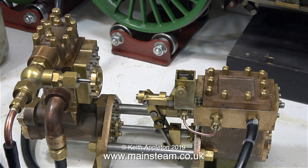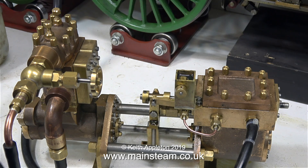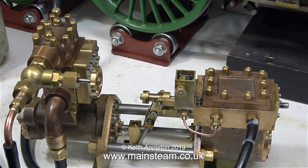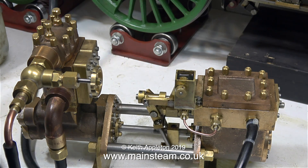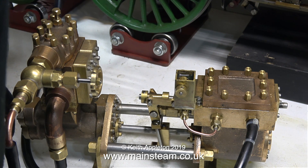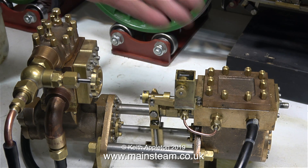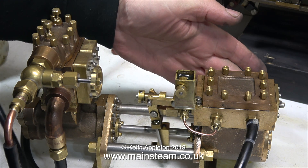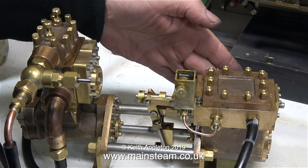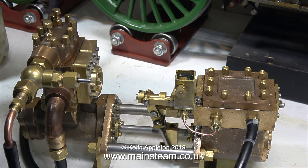You can see how much the silicone rubber tubing is jumping about with the pressure of water inside it. It would be interesting to see how much an air reservoir in the circuit, which acts as a damper, affects the movement of the pipe. I think it's time for some slow motion. It's been running for a while, and I need to see how much oil is coming out of the exhaust pipe — that's what my hand's doing behind the engine. And from the amount of oil coming out of the exhaust, I think the delivery is perfect.